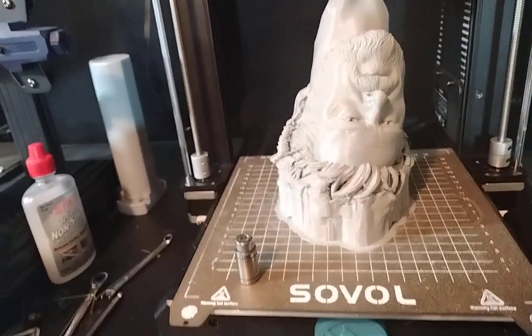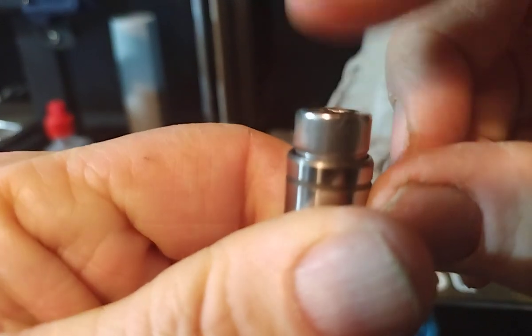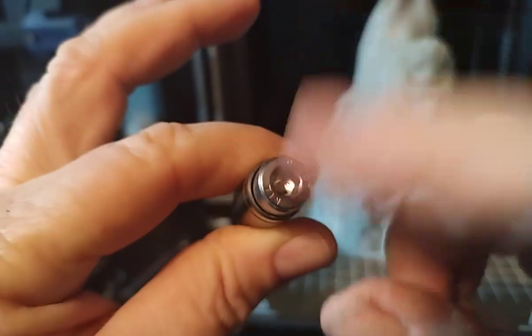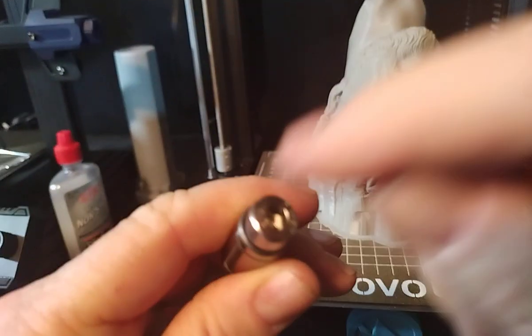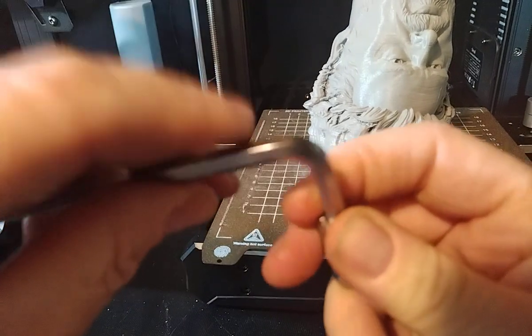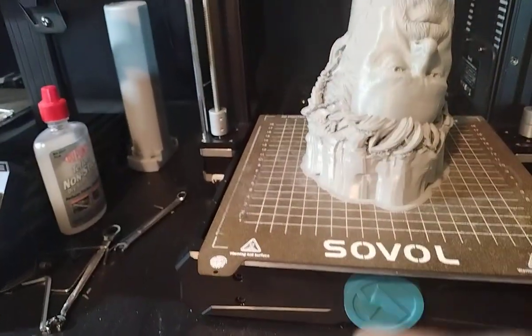For you people that might have gotten some bad bearings, this is what I did. I took a socketed head screw that fits inside there. You have to be careful — something that fits inside that upper lip — and start banging against that. I put a hex key in there and start beating on the back of my hex key to push the bearings down.